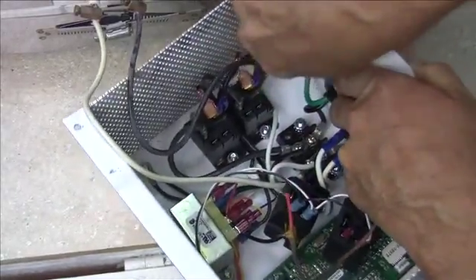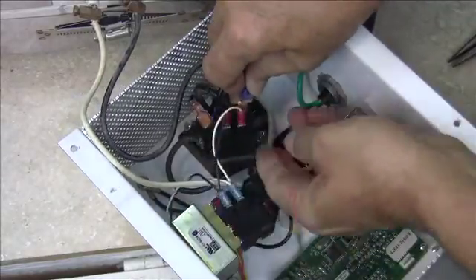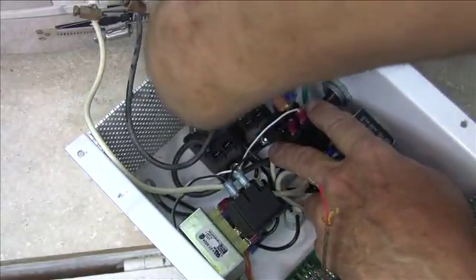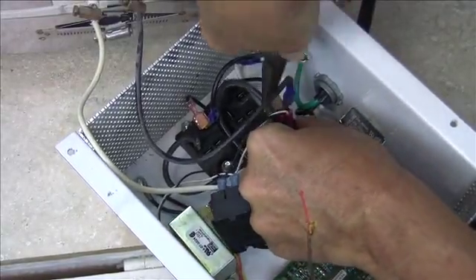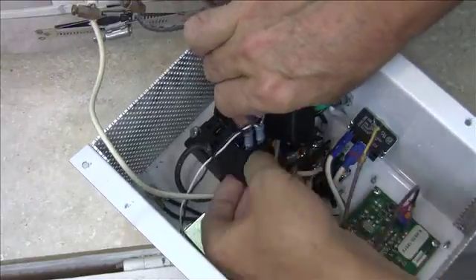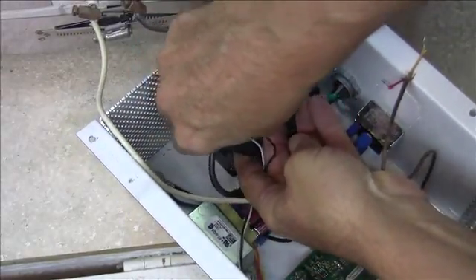Now this one back here is a little more difficult because it's two wires connected into one, so you have to give a little more force — but be careful, you don't want to ruin it. It's going to be a little harder to snap into position as well; I find using my fingers works best. Listen for the snap — it's a very big click and you know it's seated. The next one goes in the opposite direction, front to back. Take a look at the blade and you'll see what I mean. Move it front to back until that pops off, then put it onto the blade exactly where it came from. Do the same for the other relay — side to side for this one, the one with the double wire. Once it comes off, pop it into the correct position on the new relay until it snaps. Pull the final wire off — again, this goes front to back — until that pops, and put the final one onto the last blade.